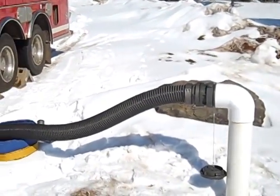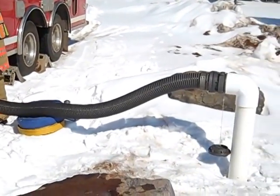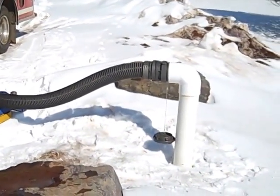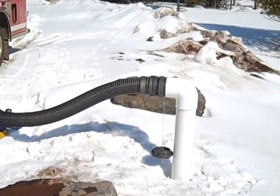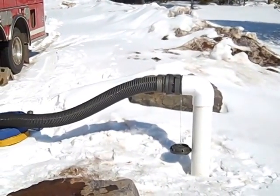So now we're going to switch to pump. We use the tank water to back flush and we also use it to speed up our prime. So now most of the dry hydrants should be filled with water. We shouldn't have a whole lot of air to evacuate.